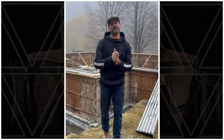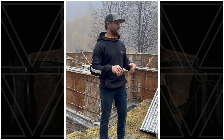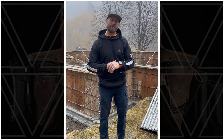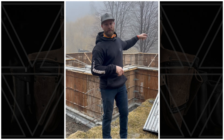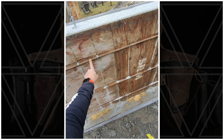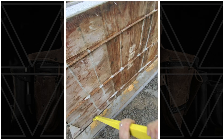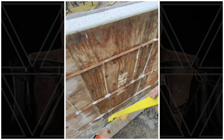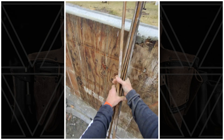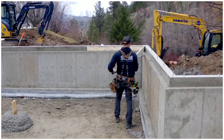Time to strip this foundation. Over the years I've become more and more particular about how I strip — I used to take sledgehammers and bars, smash the whole thing down, big piles of junk. Feels good to expose the concrete as quick as possible, but over the years I've become more strategic. What I do now: strip all the braces, pull the top plates off the forms, clean those up and pull nails, then pull off the bottom plate. Before I pull the ties off and the whaler, I remove the 2x6 so I can jam my pry bar in and pry this off — that allows me to remove the 2x6 without the panels coming with it. Then we knock the whaler bar off, clean that up, pull the panels down. Do it systematically — it's way cleaner, ends up being faster in the end, and it's much, much safer.